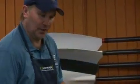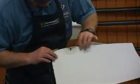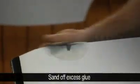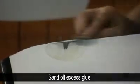Okay, this blade is one that I've repaired earlier. I've taken the squeeze clamps off and the ethylene plastic pieces, and as you can see, it sort of reforms with the adhesive where the material was missing. The next step you have to do is actually to sand the area. You can sand off the excess glue, and this sort of recontours or reshapes what the blade was.